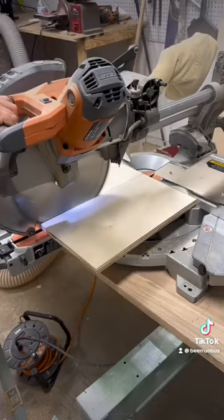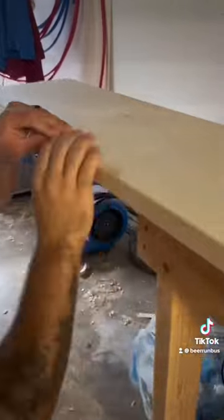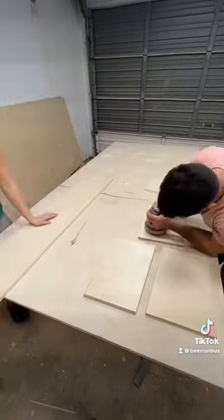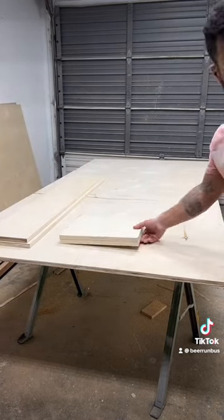We then had to build an upper cabinet — let me show you how we do it. We first start off with a piece of three quarter inch plywood, then add edge band veneer to all the edges. And once we have all of our pieces cut out, we sand the crap out of them with 220 grit sandpaper.